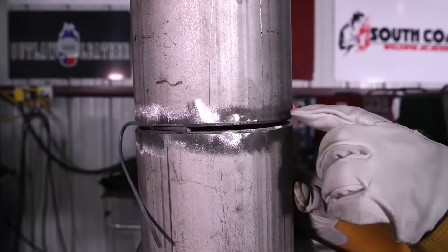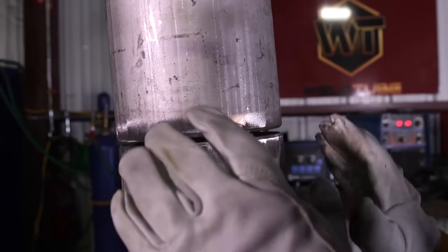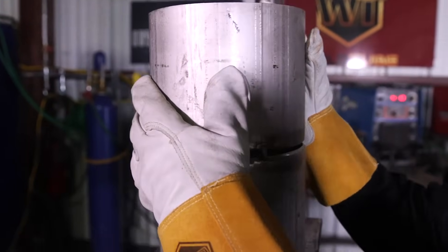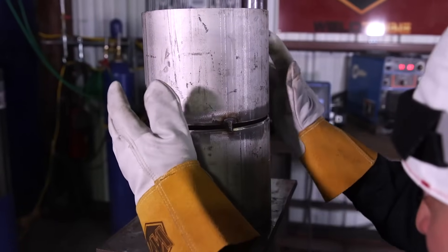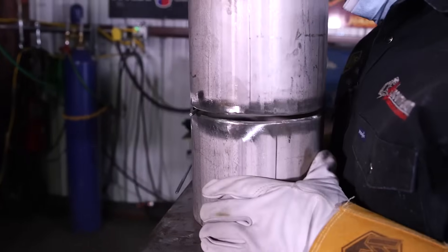If you can see it, it opens up to about 3/16 on that side. But you want to play with it — it's a little open on that side, a little closed on that side. So let's adjust it. Refit that pipe, make sure it's perfect. Also check the high-low again. Make sure that it's good.